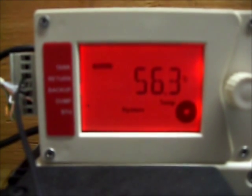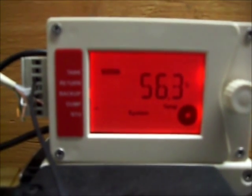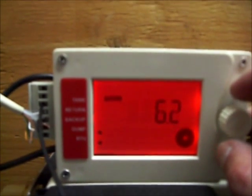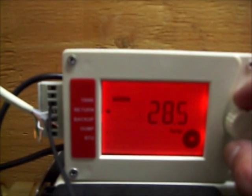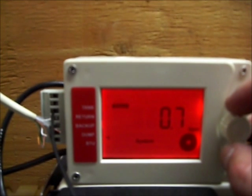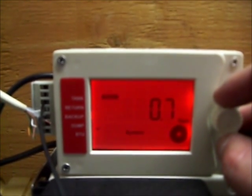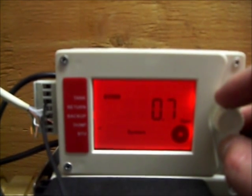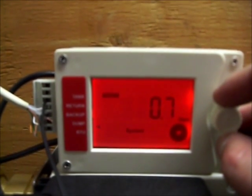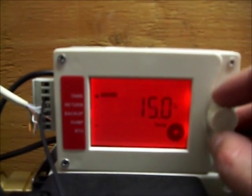You can see the temperature is slowly increasing. I just got here a minute ago and it was 53 Celsius - this is the temperature on the roof. As we scroll through, this is the return temperature going back up to the roof. We're at 0.7 gallons per minute right now. The display turns red when it's on dump load because I've got the tank temperature set so low that it's basically only going to the dump at the moment. But the entire system is functioning and hooked up.